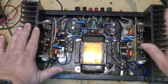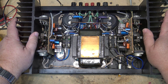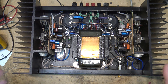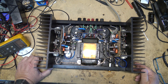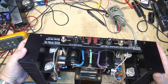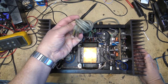I don't even think the caps need to be changed. These amplifiers don't have a protection relay on them. These were basically kit amps when they were first offered. Hafler, of course, is Dynaco — David Hafler was the founder of both Dynaco and the Hafler Corporation. They started out as a kit manufacturer. The Dynaco series were typically their vacuum tube amps, and then they went solid-state. One of the ways you can tell if a unit was factory-made or a kit is the presence or absence of a serial number plate. This one doesn't appear to have one, so I would say this amp was likely a kit amp.